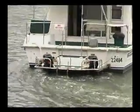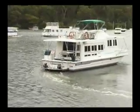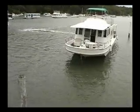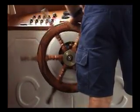Because there is no rudder, when the boat turns its back will swing out. The boat is also slow to respond when you turn the wheel, so you may over-correct to start off with. Once the boat is going in the right direction, you should only need occasional half turns to keep it on course.